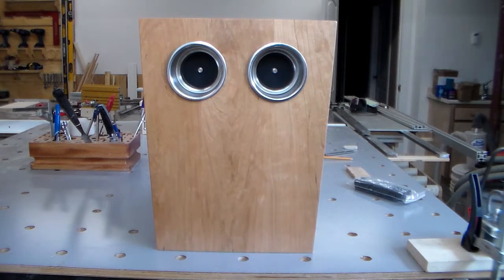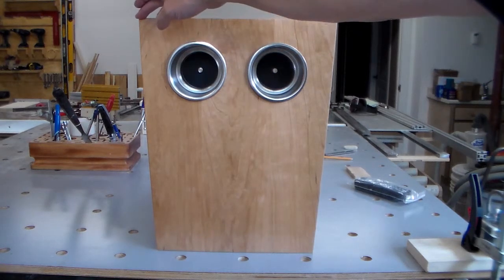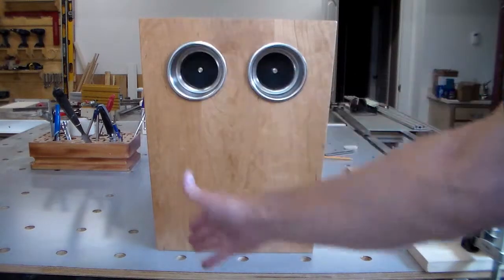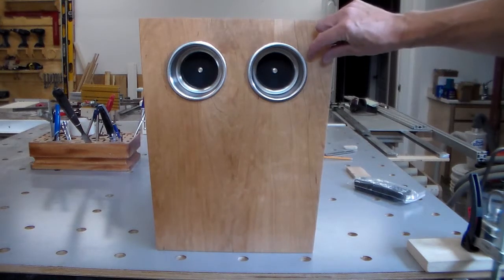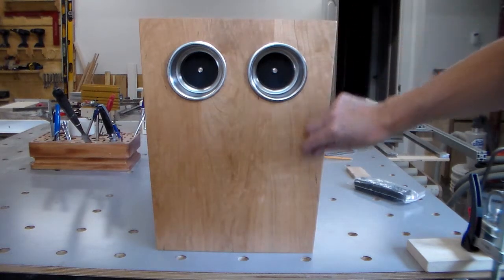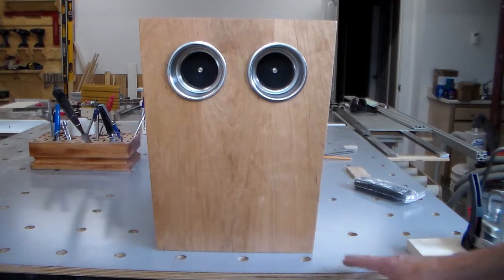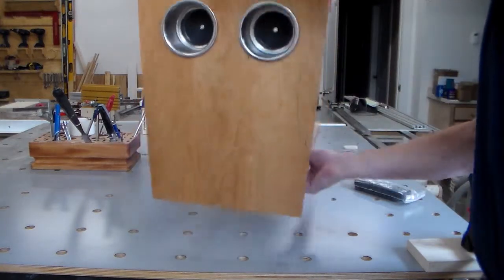So starting back from the beginning of this project, this is my top, 14 inches wide across the top, and then 12 inches across the bottom with that taper cut on both sides. So I wanted the stretchers that run on this edge to be parallel to it. So I had to develop an angled tenon because I did mortise and tenon joints in the legs. So if I turn this around now, let's just go this way here.